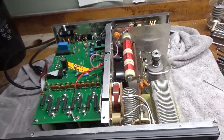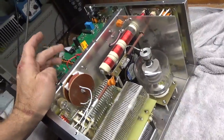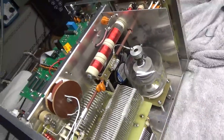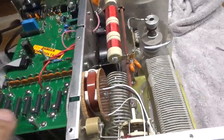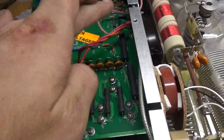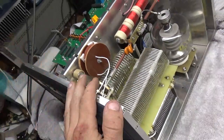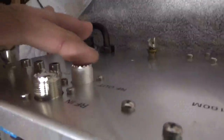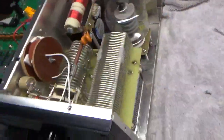It's all set — tested full output on all bands. I provide a video to the customer of it working on one band, and I email or text it to the customer. Brand new Penta Lab tube — awesome company, great customer service, I recommend them a million percent. Brand new glitch resistors — two series glitch resistors installed, variables in there, cleaned the rotary switches with Deoxit Gold, cleaned up the solder joints. Replaced the SO-239 connector with a brand new one for the output. There's the old one right here.